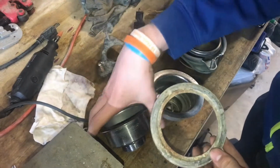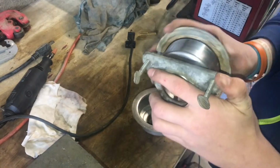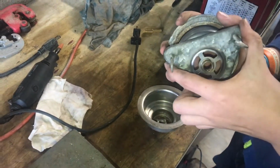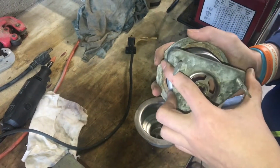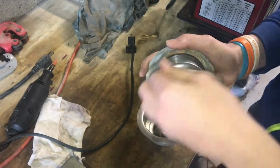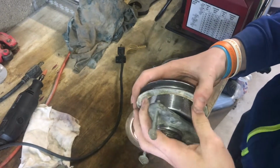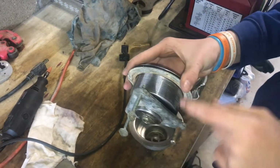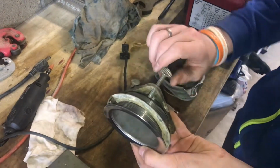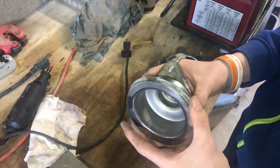And what this does, this washer goes on there, and then this piece threads onto the drain. And what this does is the nuts that are all along the outside here go on, there we go. All the nuts, these screw on, which pushes the washer this way, and which will seal it to the sink. So it's similar to that nut, except these, all three of them push it on. So this should work on the sink.